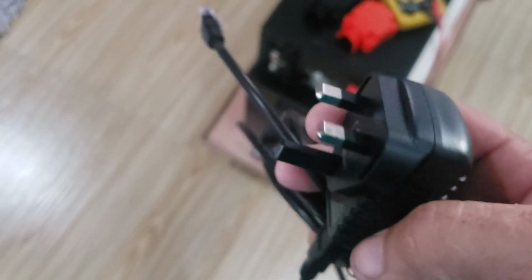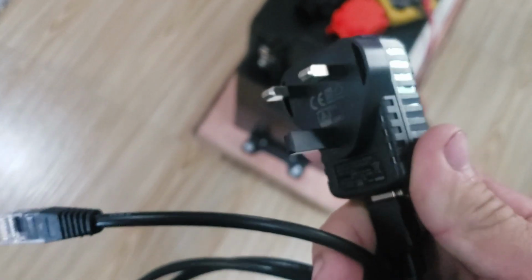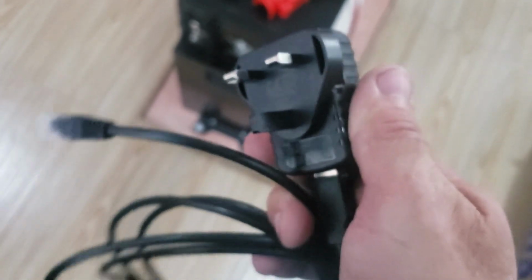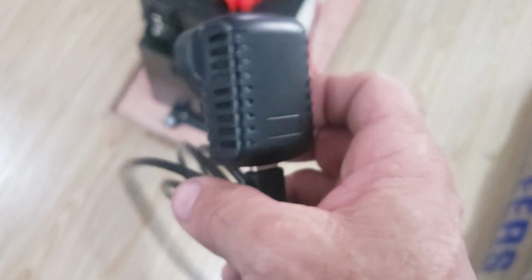That is for the recovery on it in case it was to go too low. All right, so if you have grid power, you're going to plug this in. When it senses power from the grid, hook this into the communication port, and then it's going to know to recover the battery with grid power when it returns and start charging it. So it's going to be extremely important for recovery purposes. Connect this one way or another with the grid tie or with the off grid.